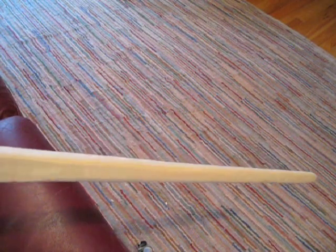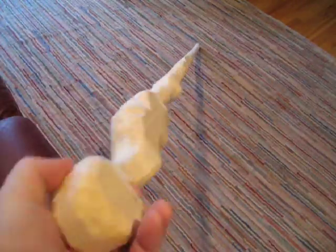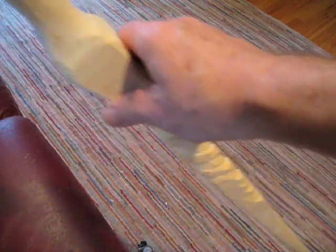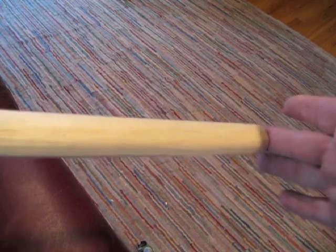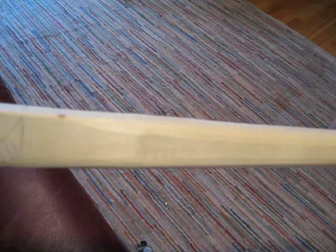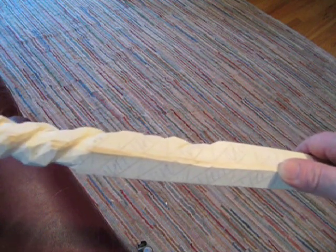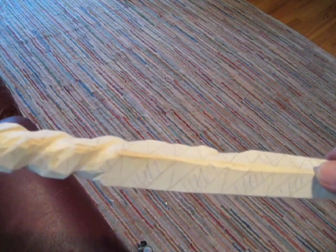Here's my stick — here's the blank I've started. The bottom part, about the bottom 30 inches or so, I've roughly shaped with a spokeshave knife. This section is going to be the spiral, from here to here — about 30 inches up. You can see I've already started the lines, and I've put some cross-hatching marks to show the part that's going to be the low section.